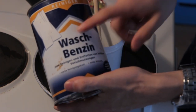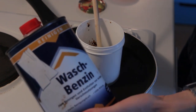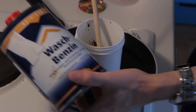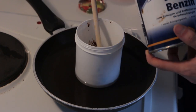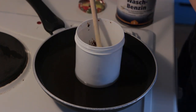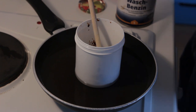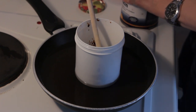The benzine will also help to permeate into the wood. If you just mix the linseed oil and the beeswax without benzine, it might just stay on the surface. With benzine, it's going to penetrate into the wood — that's basically what you want. You get all the more liquid oil and tar penetrating into the wood, and the beeswax stays on the outside making a nice protective film.